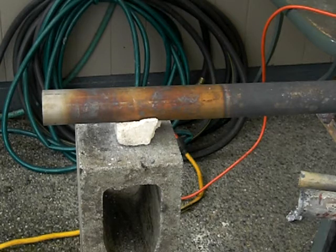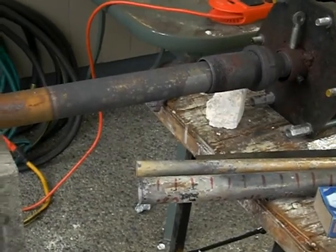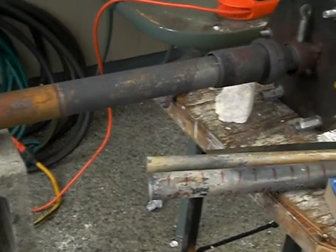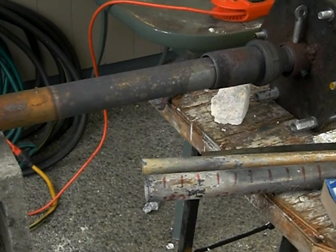Okay, what's happening here? I'm getting blow by where the tinfoil is, and it's causing a pressure difference. So I'm going to have to make sure that's sealed. That's really important when you're doing these tests. You can't have propane coming out of there, so I'm going to have to correct that and come back, and we'll retry this again.